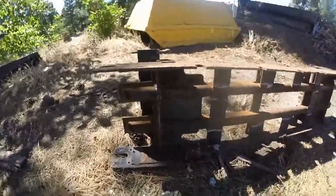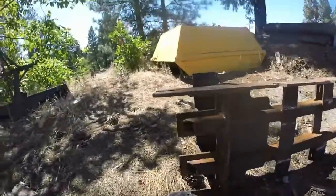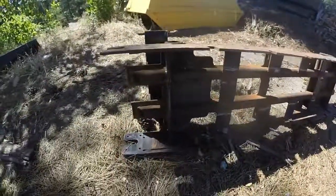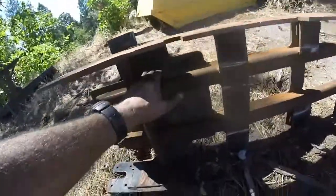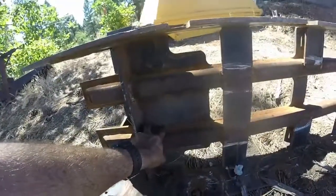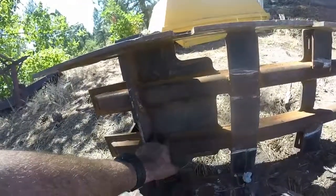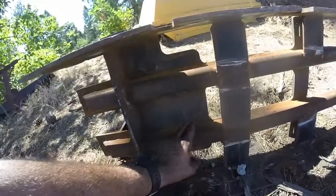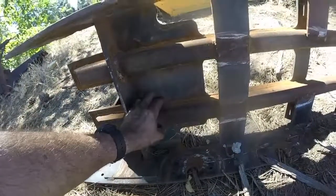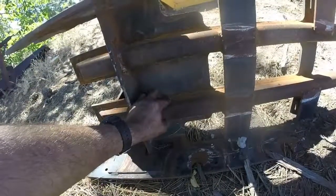Here's the other side of the track frames I've been working on already — I worked on this a while ago. You can see this is where I replaced the heavy tubes that run the full length of the track. They stiffened it up. From the factory this is fully welded, but they only have about inch-and-a-half welds here and there. What I did is go ahead and fully weld the full length, doing three passes — the hope is to really tie it together and get the flex out of it.